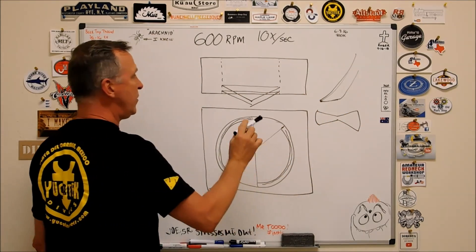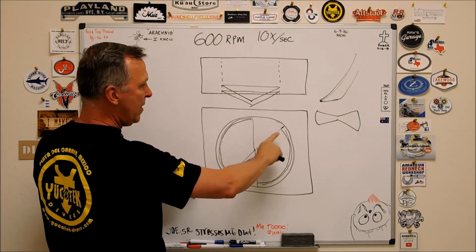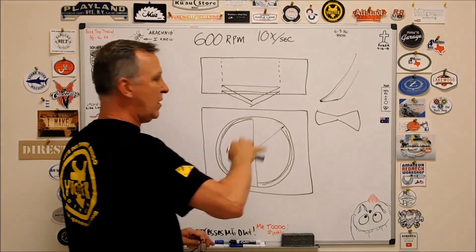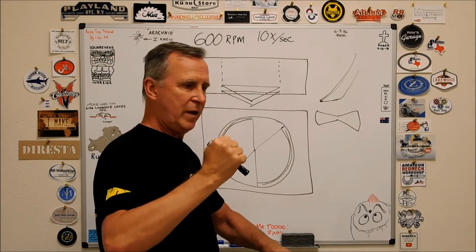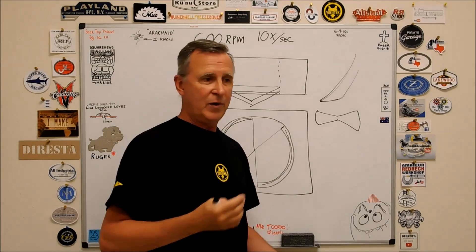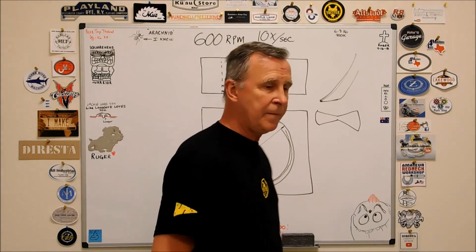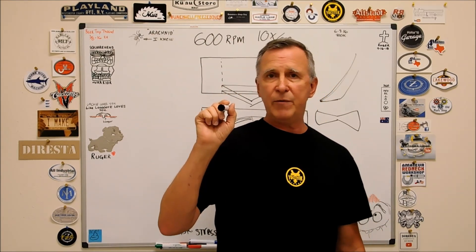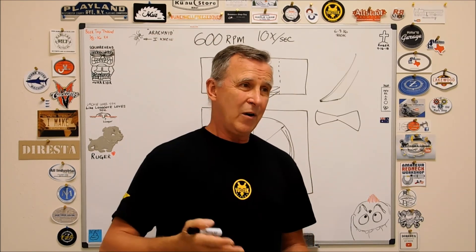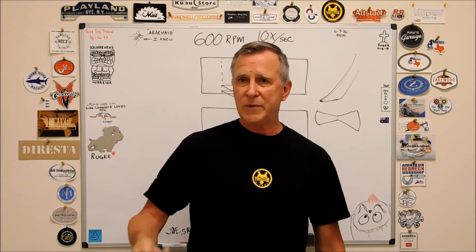That's why. Bowtie cross section on the drill: as it breaks through, the material starts to erase 180 degrees apart, you have all this remnant material left. The drill dives in up the relief flute, the part lifts, makes that clapping sound, jumps up, hopefully slaps back down to the table. You get a little heart rush, it's done — but you still need to be careful getting it back out. I'm going to show you a couple of things I've got rigged up on my machines to keep that from happening. If you have to do it freehand, there are some absolute basics you should at least try to adhere to. Let me show you what they are.